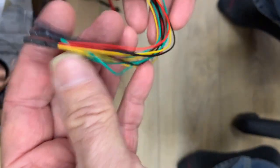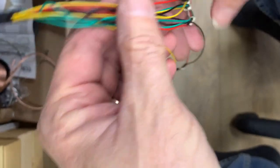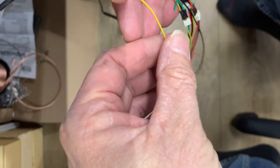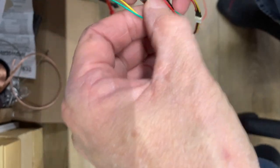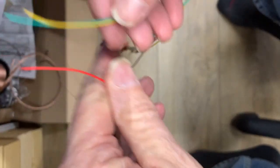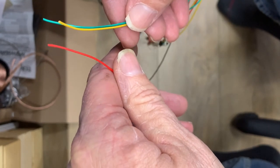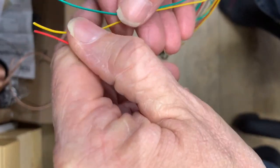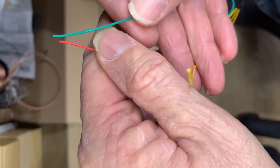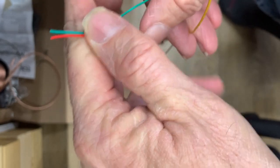Then of course it just goes to pairs. I pair up all the LED lights so the right ones are shown based on, where's my colors, green and red, green, here they are, based on which one of these is connected. So when your Tortoise switch machine, or in my case a Snail, Atlas switch machine, when these two are connected, then those particular LED lights are shown, and when the turnout is the other way, then the other LEDs are shown. So it's pretty straightforward.